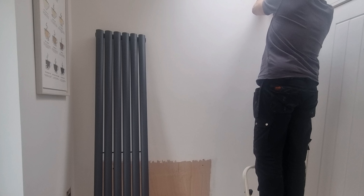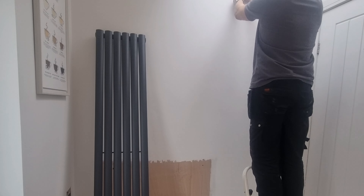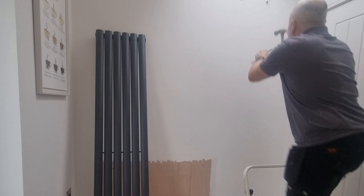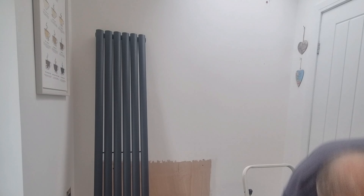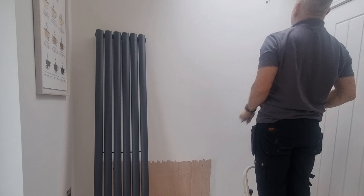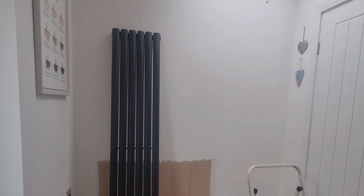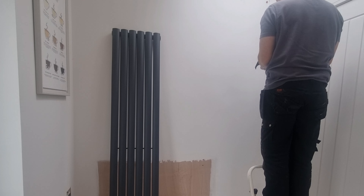You've got to make sure you put these the right way up — it's always difficult to see. I've marked them both with a pencil so I know where the upper part is. You've got to get these the right way up so the wings open out correctly. Give them a little tap in. Once they're in, you turn the screw and the wings open out behind. Because it's a greater surface area, you're not just pulling straight back through.